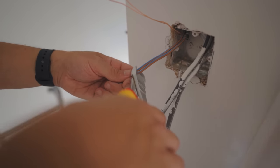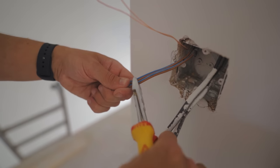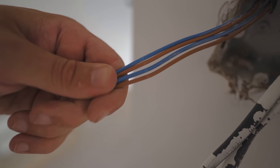What that means is you don't have to rely on marks on the cable that have been painted or plastered over. The marks can be transferred once you strip the outer sheath off — do the same marks on the browns, same marks on the neutrals — so as you strip the cable down and put it away, you don't have to keep checking. As soon as I got shown this method, it saved me so much time second fixing eight-gang switches.